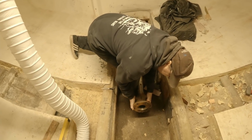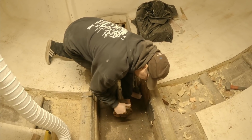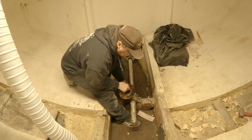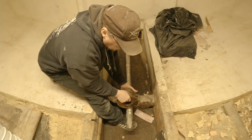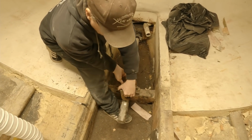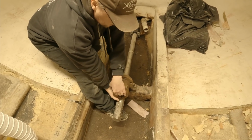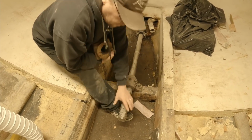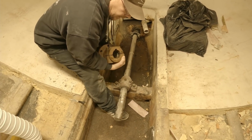We do have our new shaft. It is cut. It is on the vessel right now in a crate, and it has new couplings on it, but the new one is going to fall back about in here, I believe. So this one is going to be about right here. The intermediate going forward is the same coupling, same form factor and everything. It'll be positioned about here and going forward. So this would have actually been too long, and we would have had to deal with it anyways.